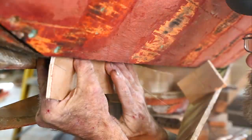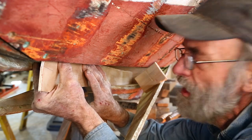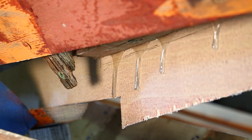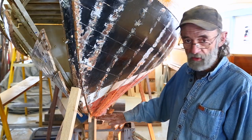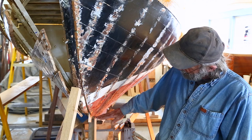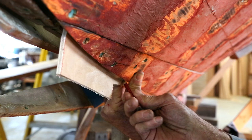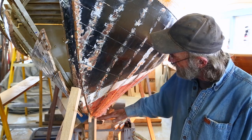I'm just holding the plywood onto the end of the stem here for the hot glue to dry. That's the easiest way to attach it because I don't want to bang nails into it or drive screws. With a little patience the glue will set, and I'll be able to remove the stem with this pattern connected to it. I fit the plywood down tightly against the top of the keel where I've trimmed it. That piece of plywood only represents the very top of the keel. For the rest of the pattern I've sprung the plank up into position and drawn the very bottom of the garboard onto the pattern with a pencil — that represents the first part of the rabbet line. It's all connected to the stem and that piece of plywood.